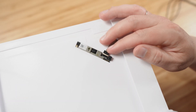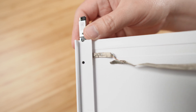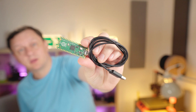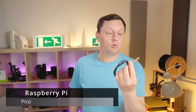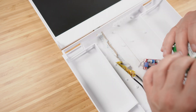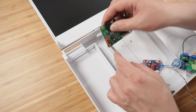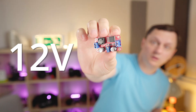For the webcam I will use a camera module with microphone from an old laptop. The microphone is soldered to the Raspberry Pi Pico, and Pico will work as a USB microphone. I will use a screen from a broken Dell laptop, with an LCD controller board and a step-up converter that converts 5V to 12V.